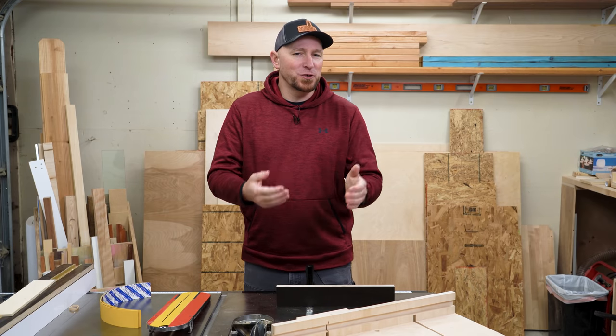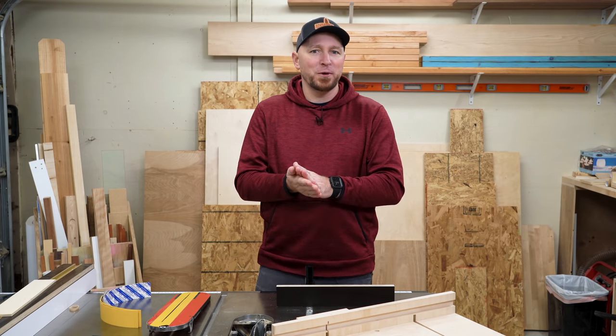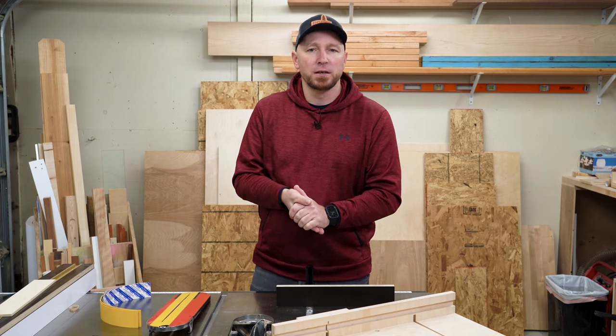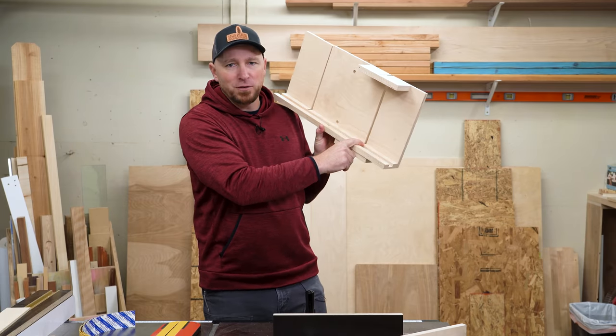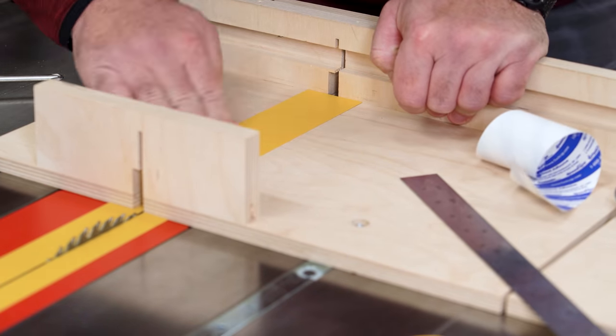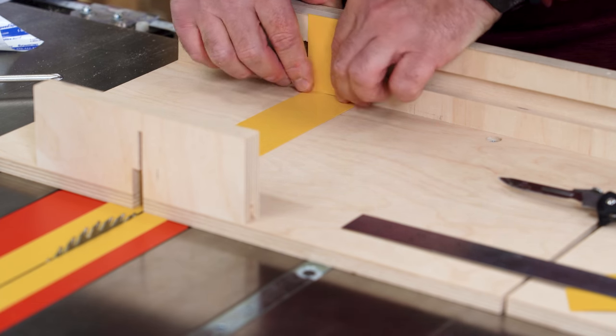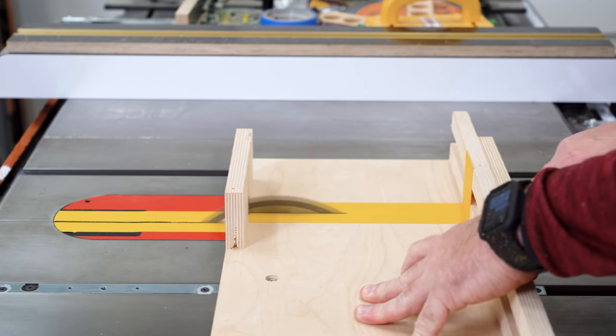One place where I think this is super helpful is the one part of crosscut sleds that's commonly overlooked by pretty much everyone that's ever designed a super fancy crosscut sled — the part of the sled that the blade slides through. We've all had a really cool crosscut sled that becomes almost useless as time wears on because the kerf ends up getting chewed up and widened out. This PVC tape is just the answer to close up the kerf and rejuvenate a worn-out sled.